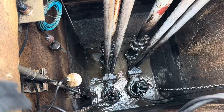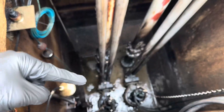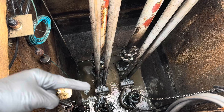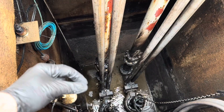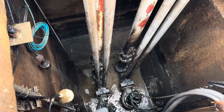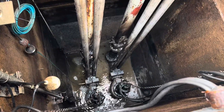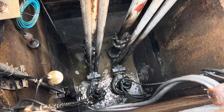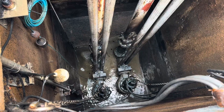We're going to pull these pumps. That bracket goes down these slide rails, and there's a discharge pipe with a seal on the bracket that attaches to the discharge of the pump. That allows us to just drop it down and have it seat. We bump them to make sure they're not spraying water everywhere, because oftentimes when you're pulling these the wet well is full.